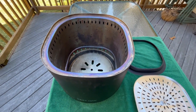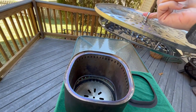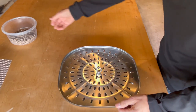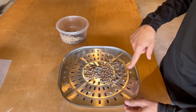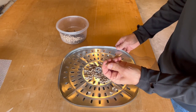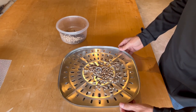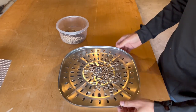It's the air coming out of these holes that makes the smokeless function possible — essentially providing combustion air to re-burn the smoke. It also has a two-part tray where the underside catches ash and the fuel sits on top. The problem with pellets is that some are small enough to fall through the holes and collect in the pan below, where they'll just smolder. The other problem is that pellets are approximately the same size as many of the holes, so they end up blocking airflow and the fire won't burn well. I need to get the pellets up off the bottom of the tray so there's free airflow through the fuel bed.